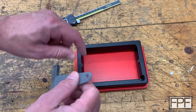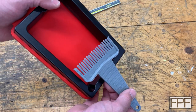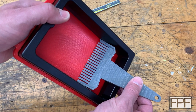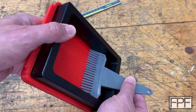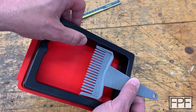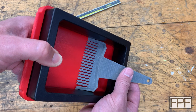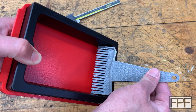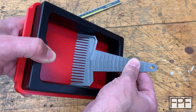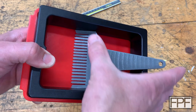And that's where this guy comes in. I designed this specifically for the Elegoo Mars resin vat, though you could resize it to fit just about any resin printer. If I drop this in here, you can see it actually pinches down just a little bit and it's a perfect fit inside the bottom part. The resin vat slopes down so that resin on the sides easily drains back in. If we push all the way to the bottom, you can see it's a tight fit on the sides. I put this in and very slowly slide it up, keeping contact with the bottom. It moves a bit easier when there's liquid in here, but it takes a while for the resin to flow through these small spaces.